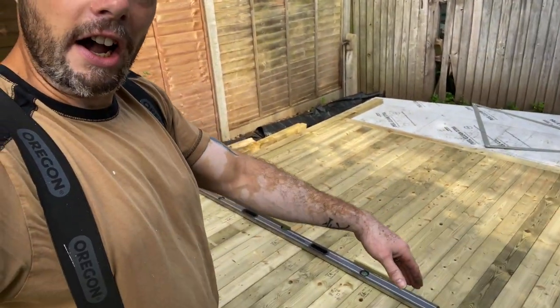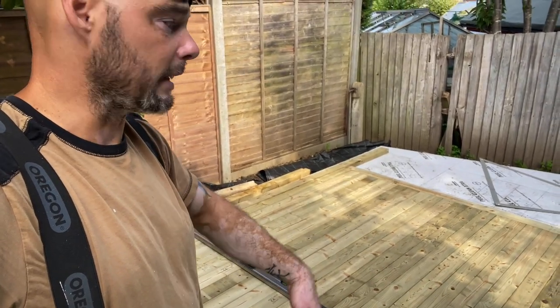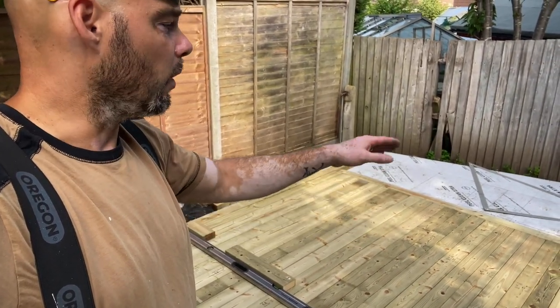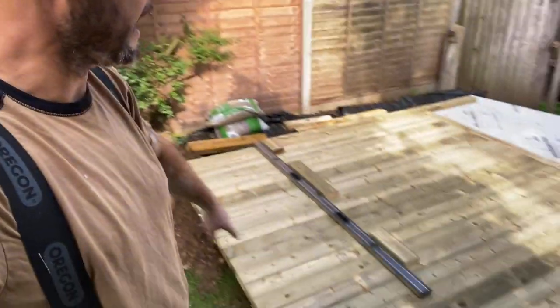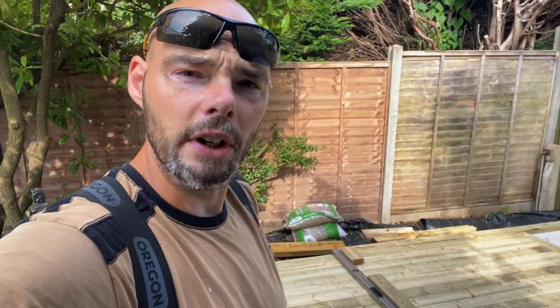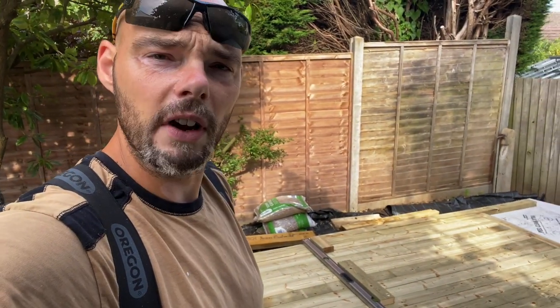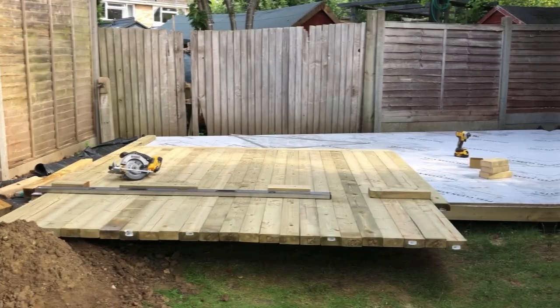You get a perfect cut every time. They'll all be exactly the same replica of each other because they're all in the same bay doing the same thing, all tight. So this is it. I'm gonna do this now. Like I said, get a hammer, tap them back, and then I will do the cut. And in one cut, I'll have 25 studs. It's really exciting. Let's see if it works.